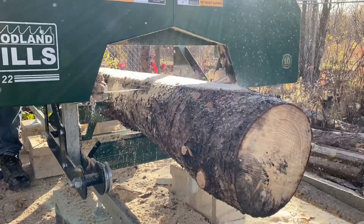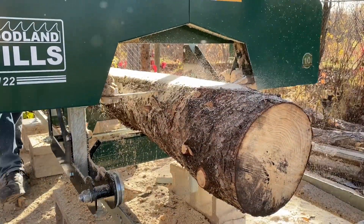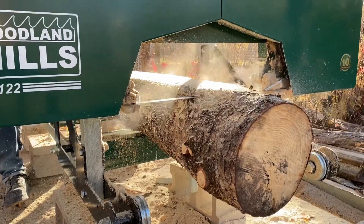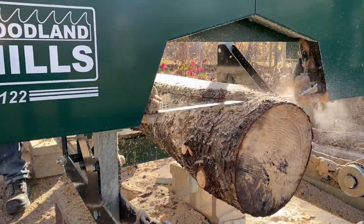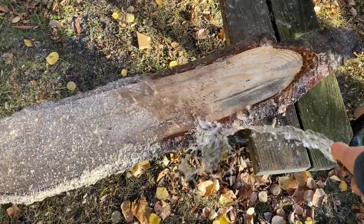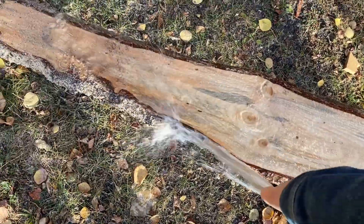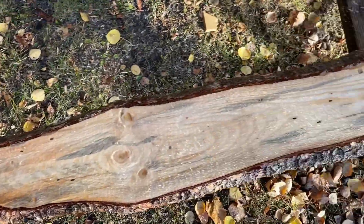These ones in particular will take probably about two weeks to dry out. If you're drying green lumber from a fairly fresh tree it could take up to one to two months, and that depends on the thickness of the cuts as well. It's important that you're storing them properly in a shaded, covered spot with adequate airflow. Make sure to put spacers in between each board to allow air to get to every single part of the lumber.